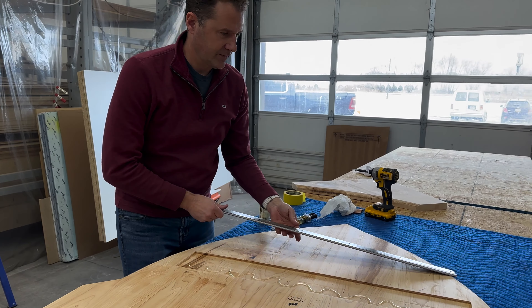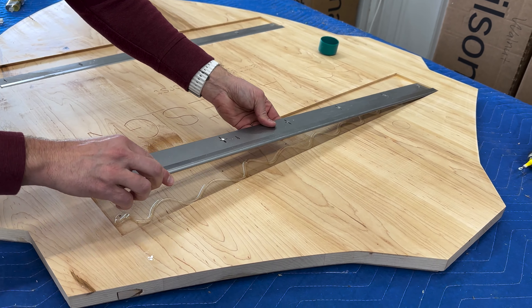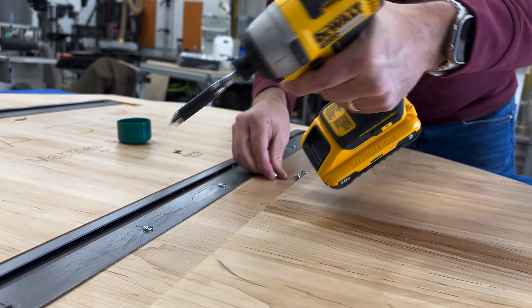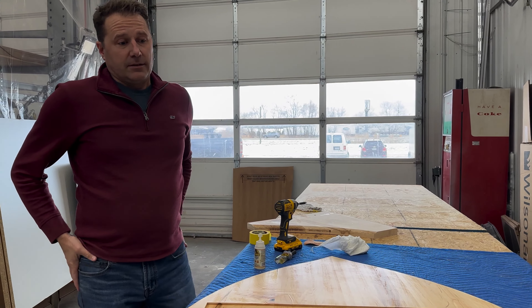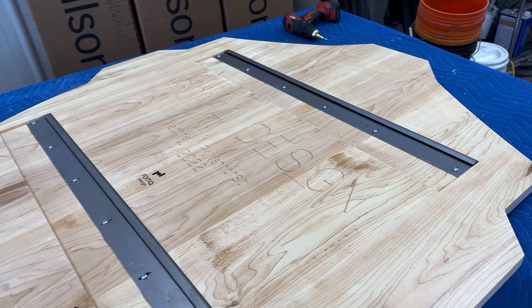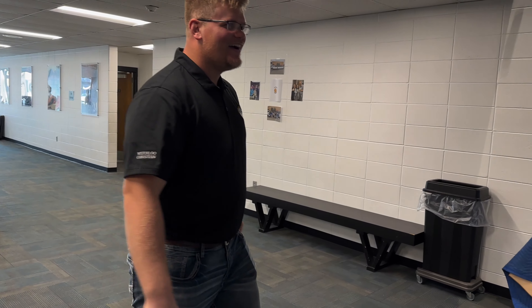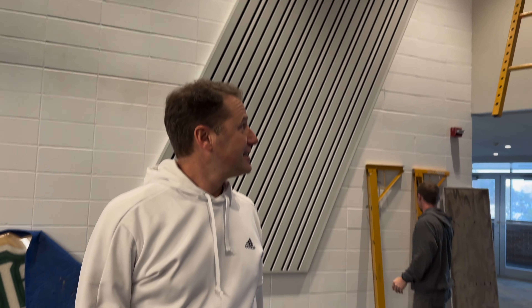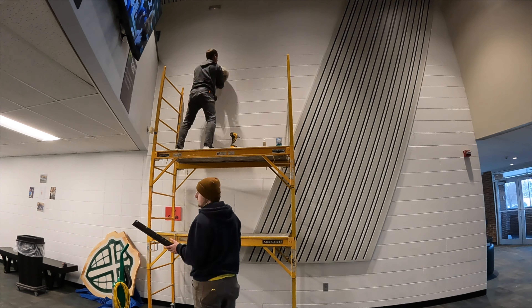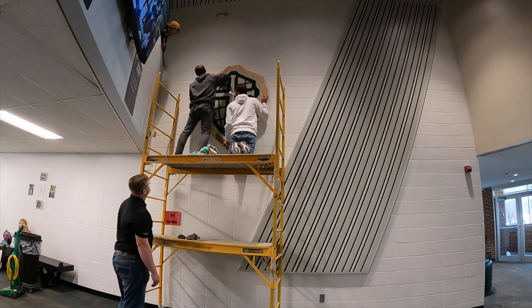We're almost there — this is the finished product on the face. I flipped it over and put a coat on the back too, just to seal everything and help keep the wood stable. Here are my brackets for hanging it on the wall — it's a two-part bracket: one part on the piece, and a sister piece that goes on the wall and they hook together. I don't think I have much more than a quarter inch of wood before I'm into the epoxy, but cured epoxy holds a screw too. I'm gluing it as well — glue and a lot of screws. The pocket was just the right depth so they fit tight against the wall.